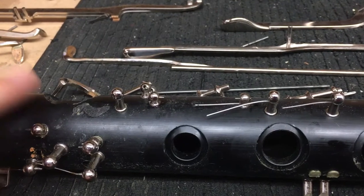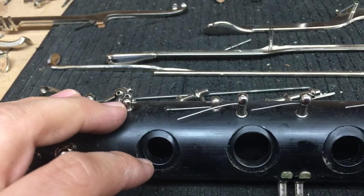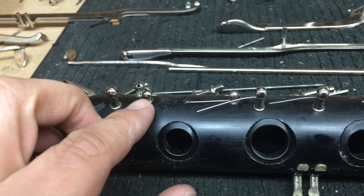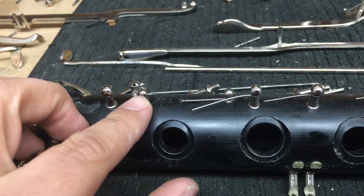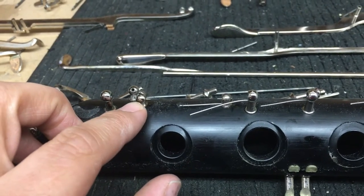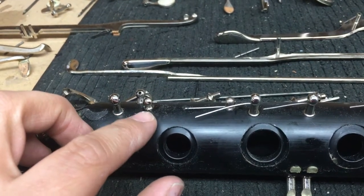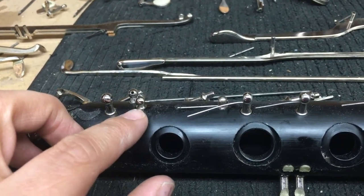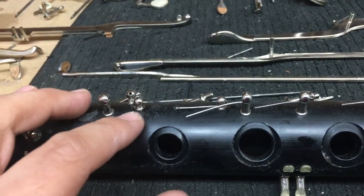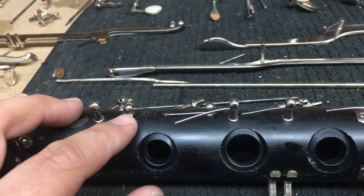As you can probably see in the speed-up video, all these little screws and their threadings are completely dry. Some were particularly difficult to remove, so I backed them off, added a little oil, and put them back in so the threading is wet and breaks up some of the compounds. Then I'll wash the entire instrument and re-oil again, because the soap and cleaning chemicals we use will degrease and remove that oil. Right now it's just breaking up whatever calcifications are inside the tiny threads.